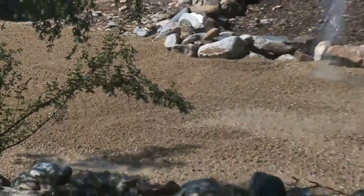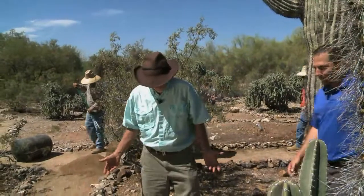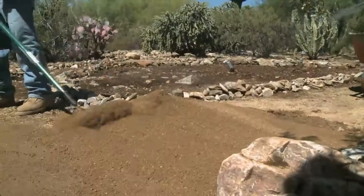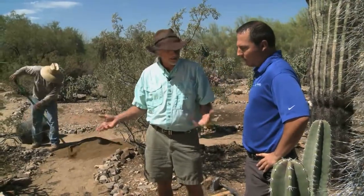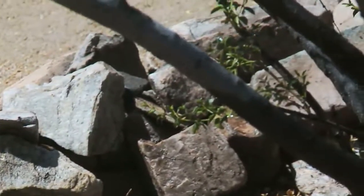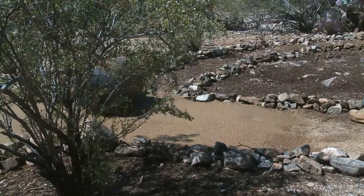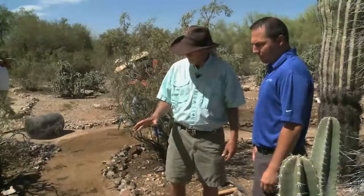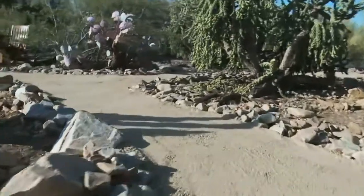So that'll compact really well for our pad — it will do very well, and a little bit of water goes a long way. We're starting to spread the granite in this area: we'll lay about two inches down, wet it, roll it, and then come back with another top-dress layer and do the same. Because the site grows rocks literally, we've decided to use those to outline the borders of the path and contain the granite. That gives it a really native look, and after compaction it'll hold up really well to foot traffic.